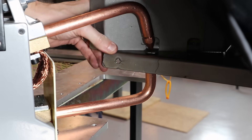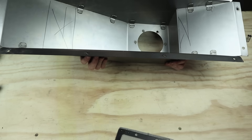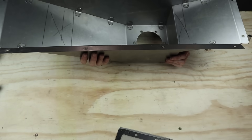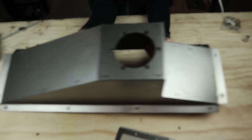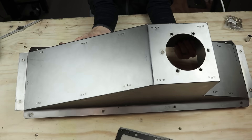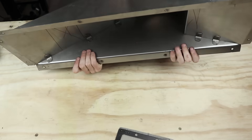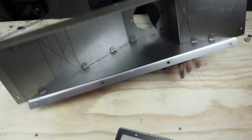I'm starting by welding all the tabs to the inner piece with all the bends, then welding the two outer panels to that. I'm shooting to have the tabs slightly shy of the edge so they're actually pulling on the panels. You can see the tabs being compressed and pulling the pieces together. Normally I spend at least three quarters of the time cursing at the welder and my fixturing, but not only was this easy, it's also probably the best results I've ever gotten. The seams are really nicely lined up — the pen plotter helped a lot placing all these bends. The spot welding is definitely a really important part; without better fixturing this would have been very difficult to hold together and weld with the TIG.